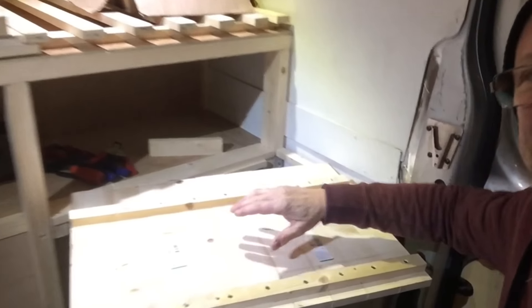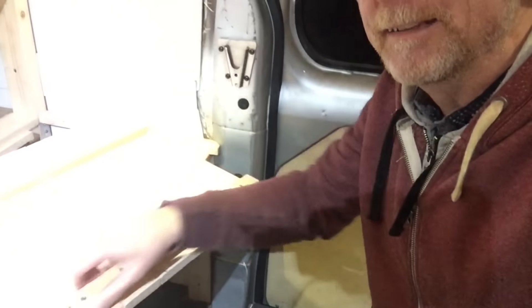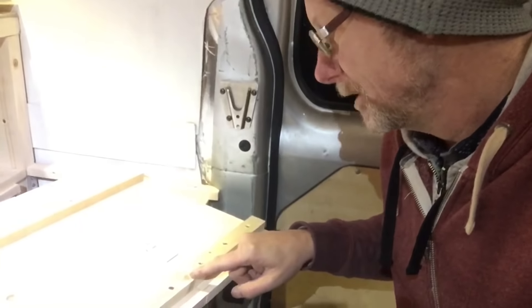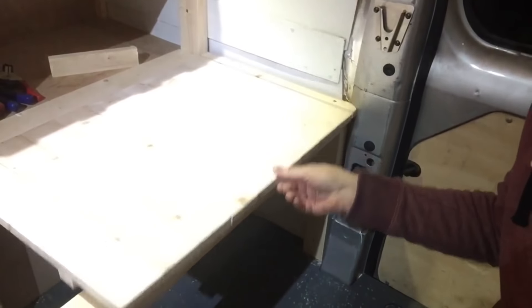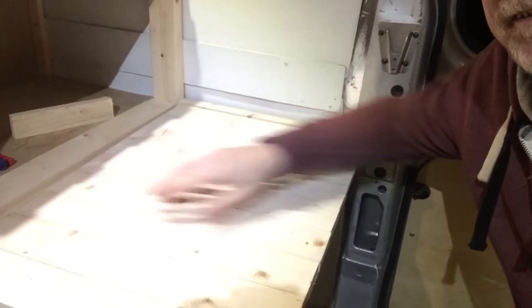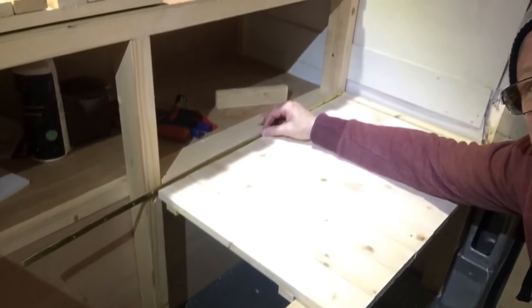Right, get sawing and screwing — back in a minute. I've made my lid, that's my lid and also the bench. It's simply slats of wood screwed together with two battens. I've only put one screw in each length of wood for now — once I've squared it all up I'll put two in and that'll hold it square. Here we go, this is what it's going to look like — that sits in there like that. I could sit on that now and I've not even put the hinge on yet. That's the whole point of that little lip — to give it support.